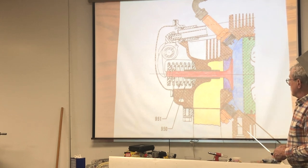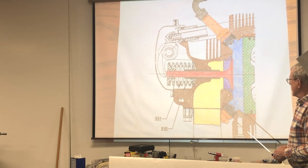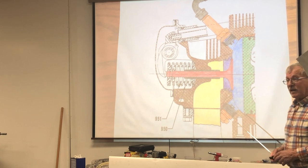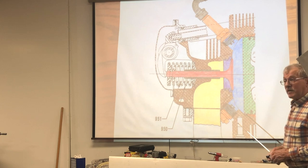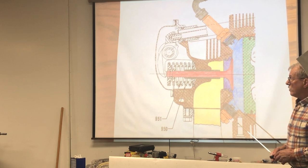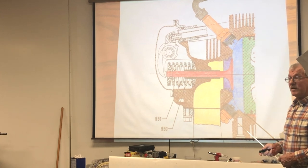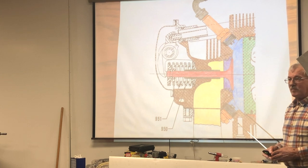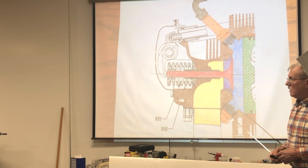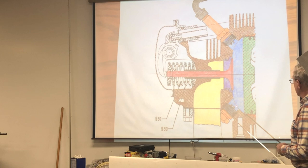So they wanted to try to find out some way to keep the little engines running without too much fouling. And they found out that if they reduced the amount of tetraethyl lead in the 100 octane gasoline, that 100 octane high compression engines would operate normally on half the lead, and it would reduce the amount of buildups in the lower spark plug, and so that's why you now have 100 low lead. It's because it's more than the 80 octane, but less than the 100 that was out there before. So you're sitting at idle and the lead is building up down in here, the vapors and so forth here.